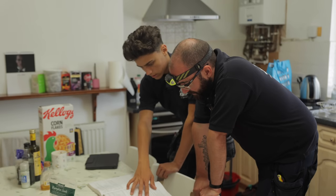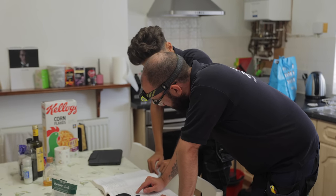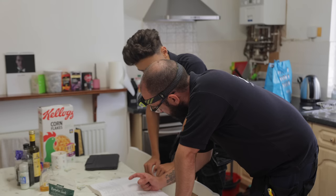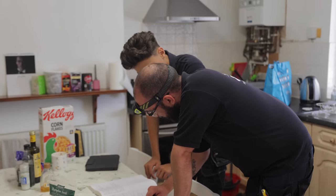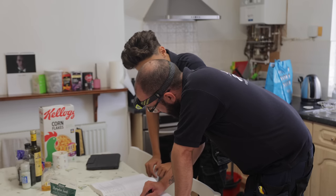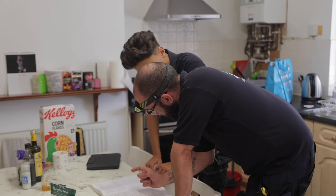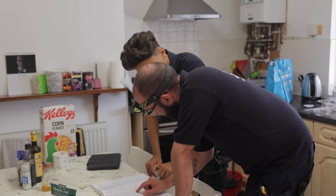This one, 13.1, says durable warning notice with the words safety electrical connection do not remove. You'll notice on those bonding tags those words are written on them. It shall be securely fixed and visible near, and it needs to be at every earthing conductor or earth electrode. If it's at the MET, there needs to be a label there. At every bonding conductor or extraneous conductive part in the MET.